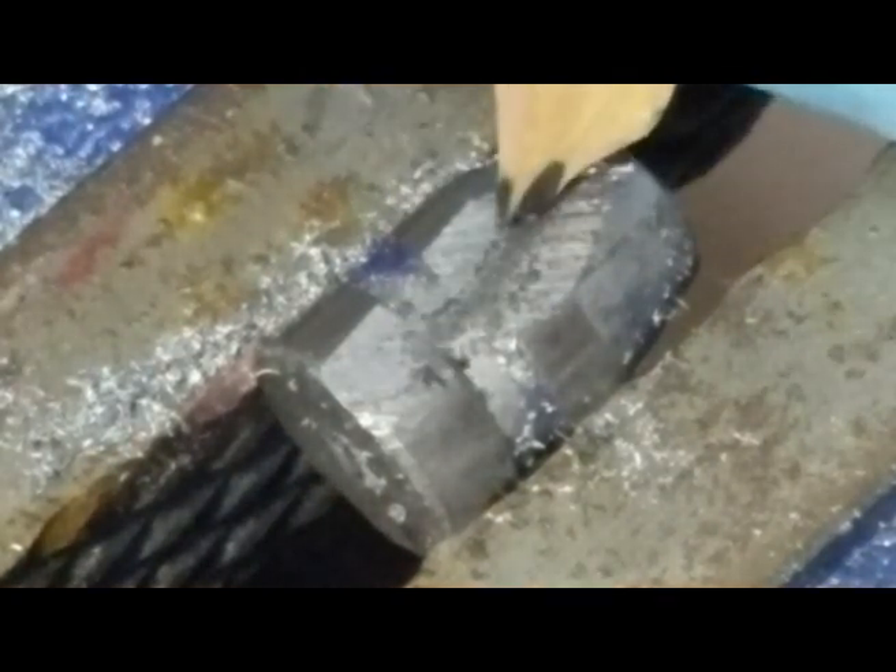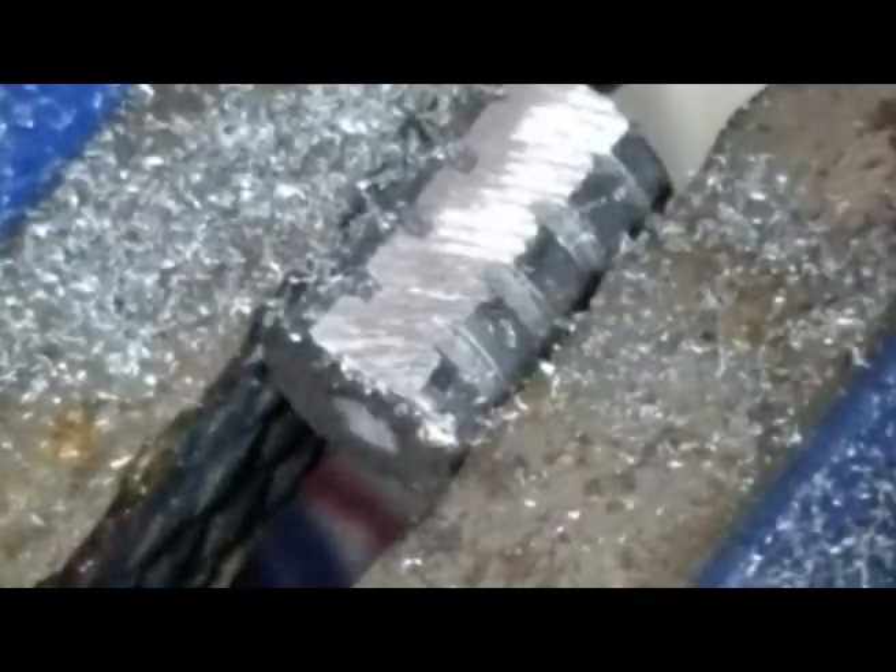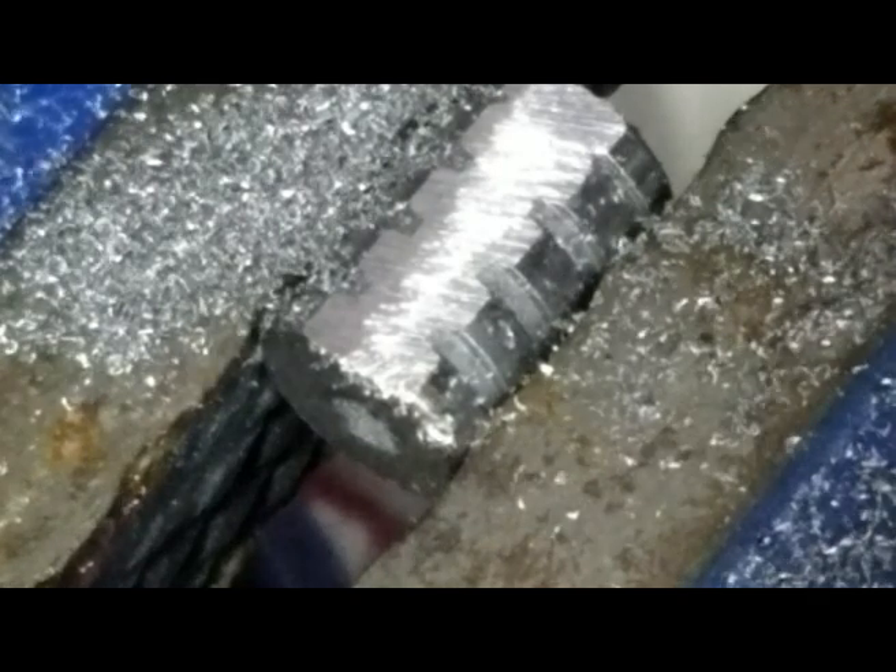Here's a cast bullet — removing the water quenching means it'll be about one Brinell number above the base alloy. This bullet is a little bit harder. Here's a 38 wadcutter and on this one you can really see it dig in well — I'll slow down the video so it shows up. See how it's digging in and the lead is curling up? That one was done at the right angle. I've used a file to do it before but this works fine.